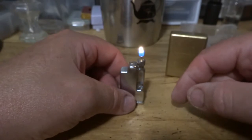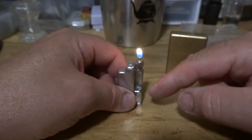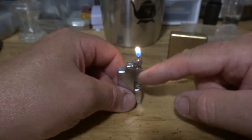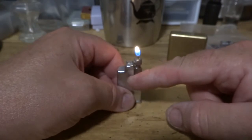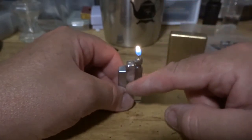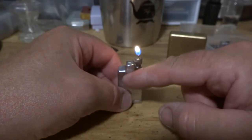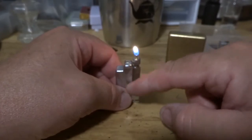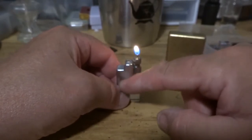You've got to think: I'm going to stick some cotton in that tank. What's that going to do? Well, it's going to soak up the butane and give a more consistent, steady supply of gas up through here. If you just have liquid in the tank, air rises to the top — you're going to get air up in the burner and the flame will go down, then more butane comes up and the flame goes up. But if you've got cotton or something in there to soak it up, the butane liquid will be distributed throughout, giving you a more consistent flow of gas to the burner.